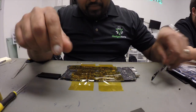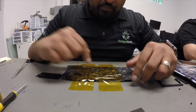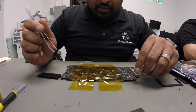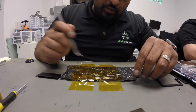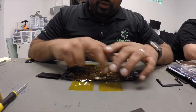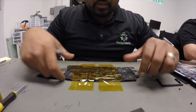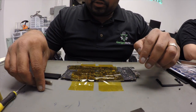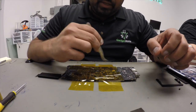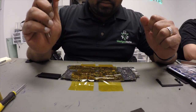I'm back — got my heating gun ready. We are using a rework station to do this. This chip has a small dot marking position number one; you want to make sure you put the new chip on in the exact same position. Also make sure that when you heat this board you heat everything evenly — you're not putting heat in just one area. This is a cold board so heat disperses and gets absorbed pretty quickly. Heat the whole board, do a circular motion, then hit the center of the chip when you're ready to pull it and it should come off with no problem.